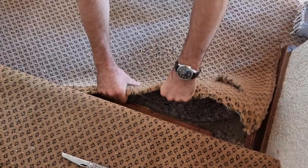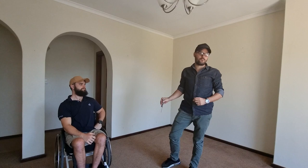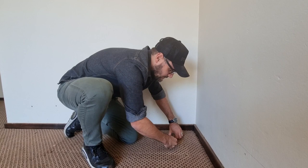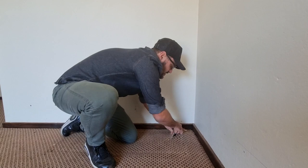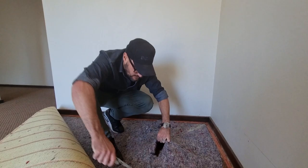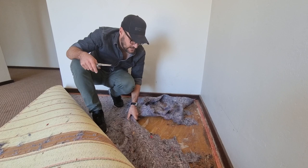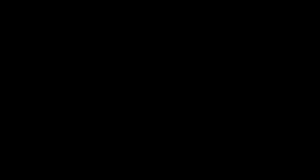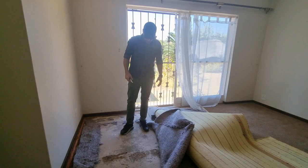Just a heads up to what we're doing - we opened up the carpet and we want to open it at a few places to see what flooring is underneath. If it's nice concrete throughout, we might actually consider not tiling this house at all and having polished concrete throughout. It does take some hassle in terms of cleaning up because a lot of this is typically glued on. There's a crack I need to look at - this is going to be a bathroom - but we can fix it up and tile over it. It's floated quite neatly so it might be something we can use.